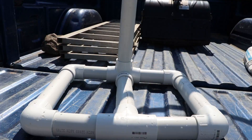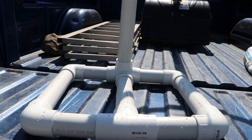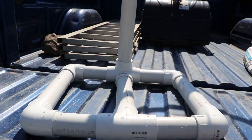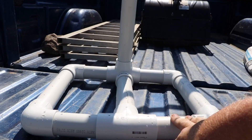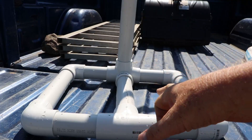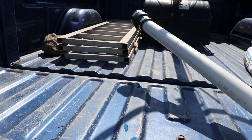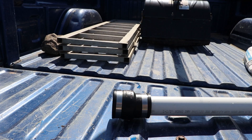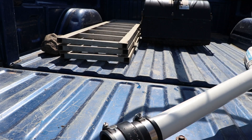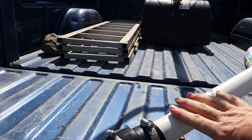Here's the manifold pulled out of the barrel — all of this is made out of inch and a half PVC. I have four elbows, two T's, and one cap. I did buy all of the inch and a half PVC; it comes in a ten-foot section. It is much cheaper to buy it in the ten-foot section than the two-foot section. Here's a price breakdown of everything. There's also a rubber coupler with hose clamps on it — that is where I attach the hose from the shop vac to the manifold.